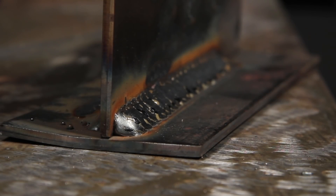Travel speed is an important factor when making a good weld. If you travel too fast, the weld may not hold. If you travel too slow, you could get too much penetration and maybe even burn a hole in what you're welding. As a general rule, you want the side of the bead buildup to be as thick as the thinnest material you are welding.